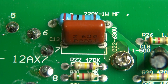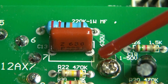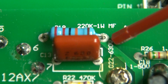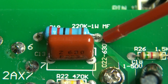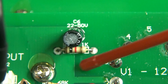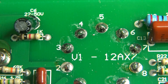Before I attempt to re-solder C13, I wanted to show you these pads. See those pads under the cap? They're like dry — there's no solder there. Granted, it makes its connections underneath the board, so that may not be an issue. But if you look back here at this resistor, same condition. If this one's supposed to make a connection on top of the board, it's dry too — and that's not good. So I'm going to go around here, fix up a bunch of these connections, and hopefully that solves it. Here's another one — see the old 1K? That pad is a ground pad. I don't see much solder there either. So touch it up and see what we get.